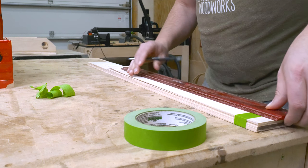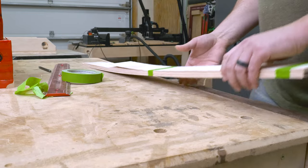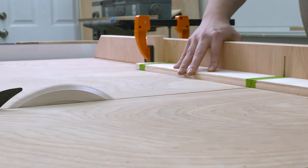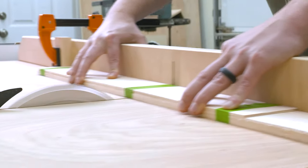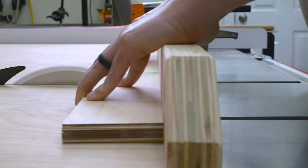It was then time to cut the veneers to their final length. I used painters tape to hold my laminations together and reduce tear-out risk. When cutting veneers for inside and outside diameters of a circle, the outside veneers are obviously going to be longer than the inside ones, so you need to account for that when cutting to length. I like using my crosscut sled at the table saw, but a miter saw is also an option.